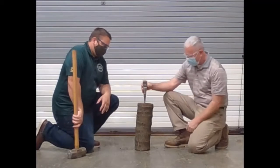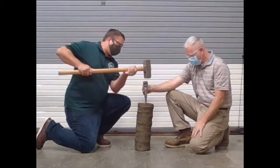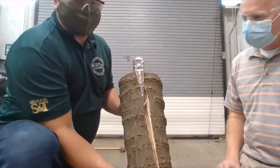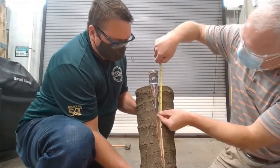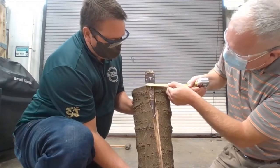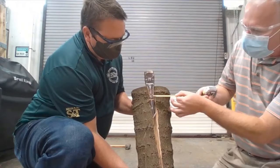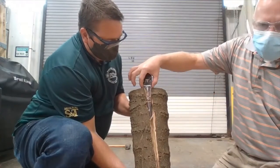So this distance across — let's give it a try, Mr. Claney. It looks like we drove our wedge about six inches down — correct, six inches down. That's the effort distance. The resistance distance is one and a half. So if we take the number six divided by 1.5, we get four. So we have a four-to-one mechanical advantage.